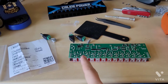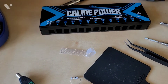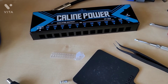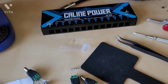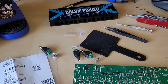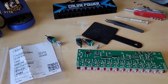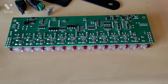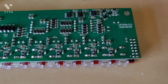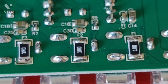Under full load with each of these outputs, if I tried to load it up to a hundred milliamps on those 100 milliamp lines, or 300 or even 500, the voltage would sag too much to where it would not allow the pedal to run properly. It came down to a simple resistor value change — specifically these current limiting resistors F1 through F12. In this case they have to be one ohm.